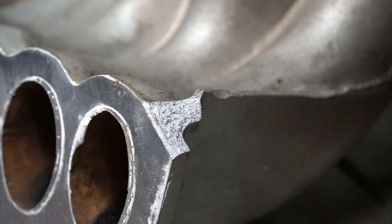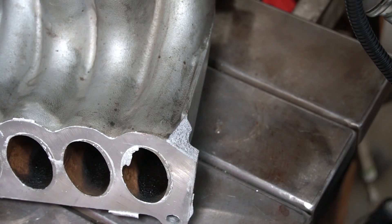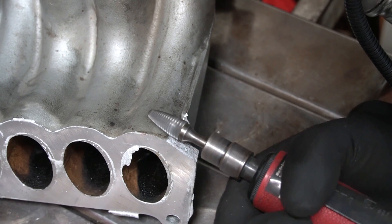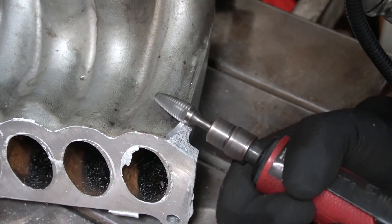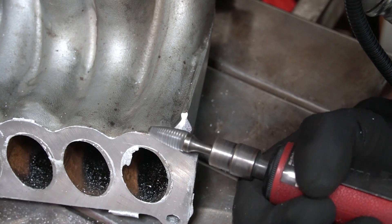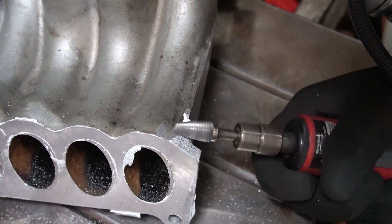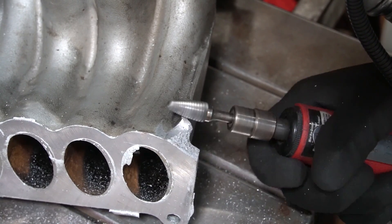It's really hard to weld these back together unless you have a really good solid process. Each one is a little bit unique, but generally we're trying to find a couple of good surfaces to build up enough metal to put back in there that will make it hold. We don't really want to try and weld this back together entirely — we're just making a couple places that will stick and create some strength back within that metal. We want to put some good metal back in there on a couple of good surfaces, but we can't weld the entire thing from the inside out because you're basically going to make another bigger sponge.